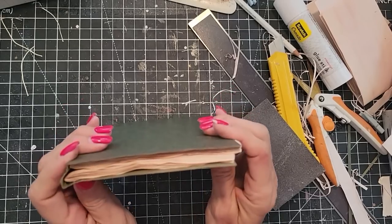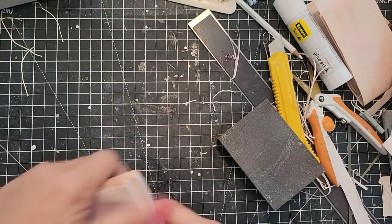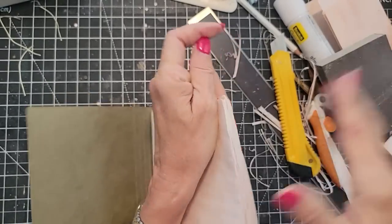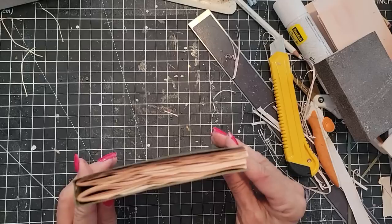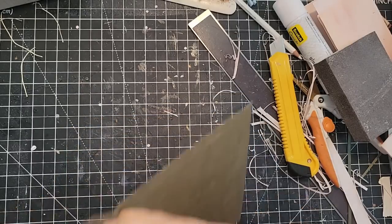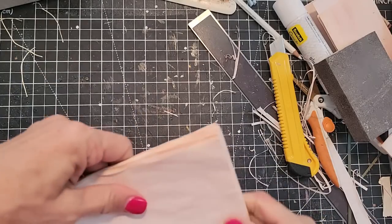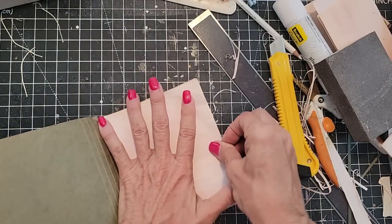Let's see if we're progressing here. Still sticks out. So what we'll do, we'll keep shaving. I think it's the back one that really needs it. For some reason, okay — if I hold it like that it looks better, but then if I rotate it back a little bit, the back one translates forward. So I'm going to let it translate forward a little bit when I cut it and put it down. I've got a sharp blade now — everything should be really good. I might even come in with a sand at the end.